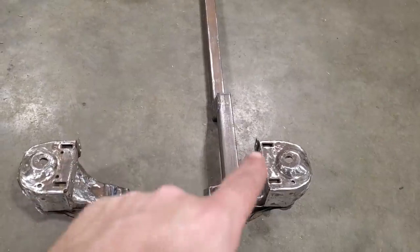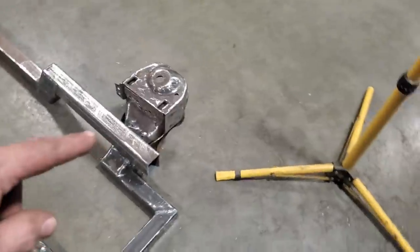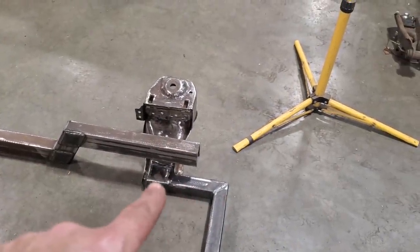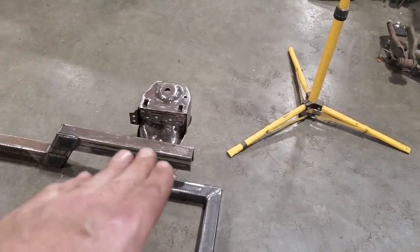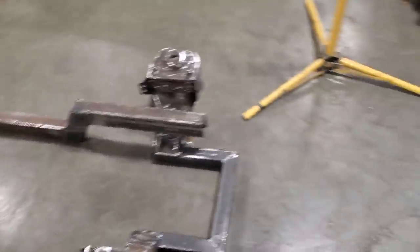So it's just a matter of sliding this into place and welding it on. This here has to be level with this down here, because this is that cross member. I made this level with the factory cross member, so all that there has got to go. So when I set this up, upper section up, I'll set it up to be level with that, and then it'll just go level throughout the car that way.